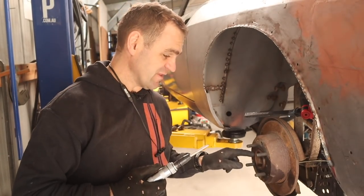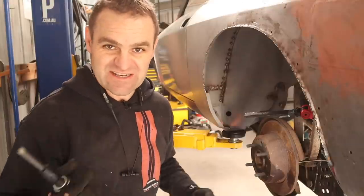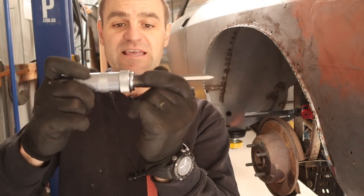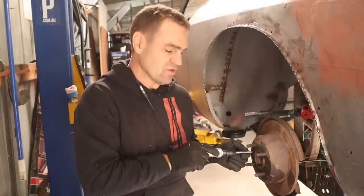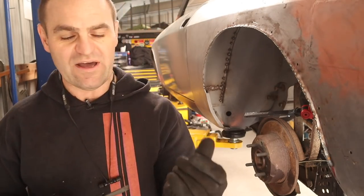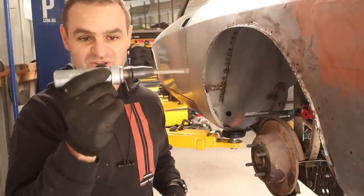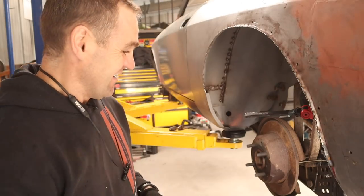This thing is invaluable for this sort of stuff. There were two flathead screws holding in the brake discs and they're seized up with lots of corrosion from years of sitting around. This is an impact driver - the old school version. Basically when you hit the end it's spring loaded and it actually twists the end, so you're hitting it into the spot and as you hit it's giving a little twist - much less likely to round over the end or break them. I tried a couple of times with screwdrivers and it was slipping. I'll put a link in the description - these things are great and well worth having in your arsenal when you're dealing with rusted stuff.